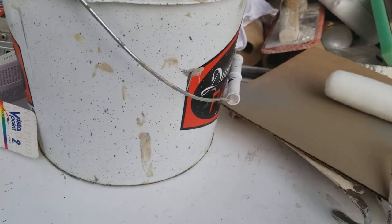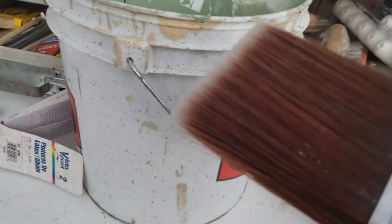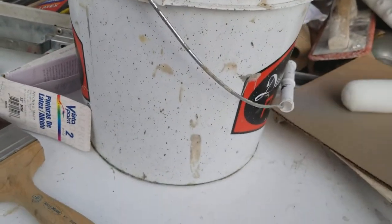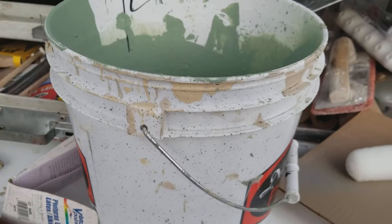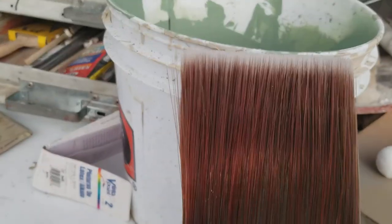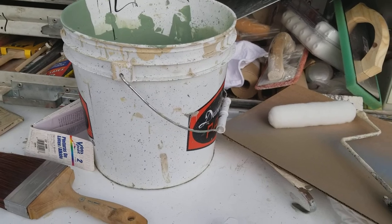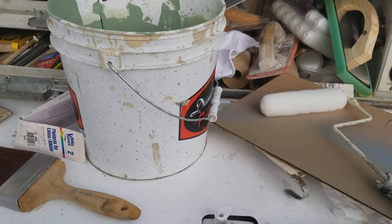I don't do that — my work will never have an ugly fat edge on my jobs, I just won't allow it. Those are a couple of pointers you can use with or without a Slim Jim. I highly recommend when you're cutting in not to use a Slim Jim. Guys like to use these in their buckets because they have too many tools in there — it's just more work, more time, you're losing man hours. You're trying to make up for not using the right tool, which is a flat cut brush. Those are a couple of common mistakes guys are making, and a few things you can do to use a weenie roller or Slim Jim roller for your cut in. Talk to you in the next video.